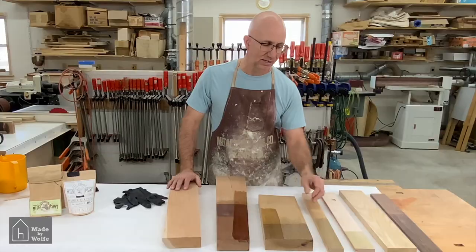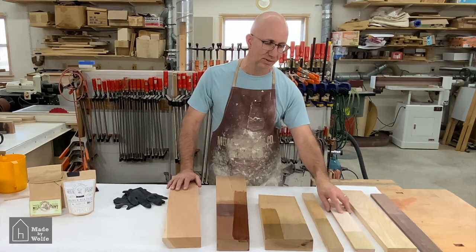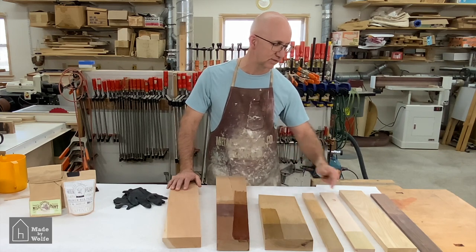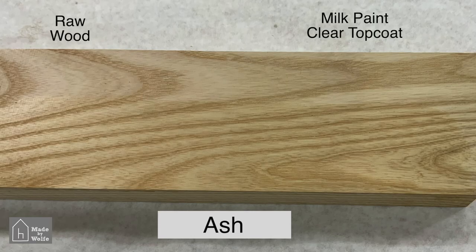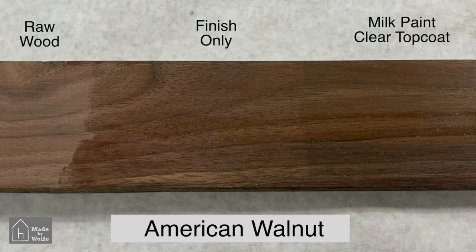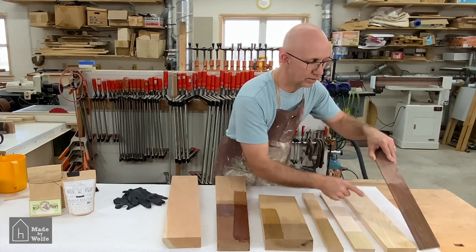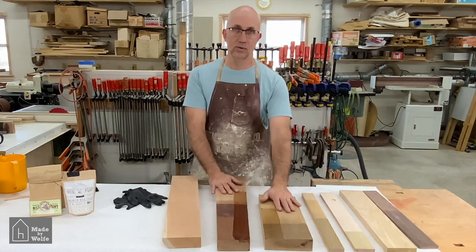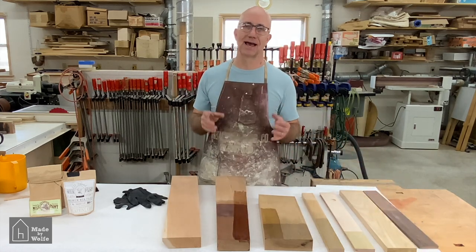With red oak I'm not really impressed, though if you like that look you can get it. Next to it is maple — I really don't like maple with this. It's almost a yellowy, muddy kind of color. Next to that is ash — you really can't tell, but milk paint has been applied to this end of the board. There's almost no change at all in ash. And then finally there's walnut — there is a change, but it turns it browner and removes some of the rich red undertones naturally in the wood. So not necessarily a fan of that. But for white oak, and especially for cherry, it makes a dramatic difference.